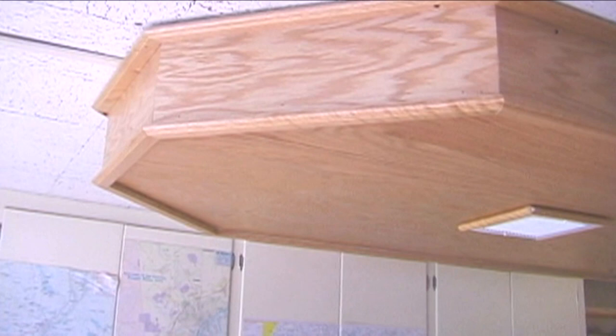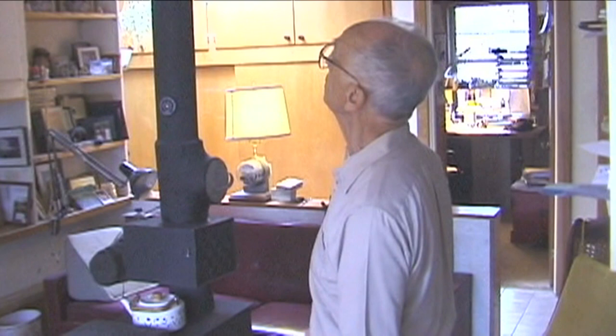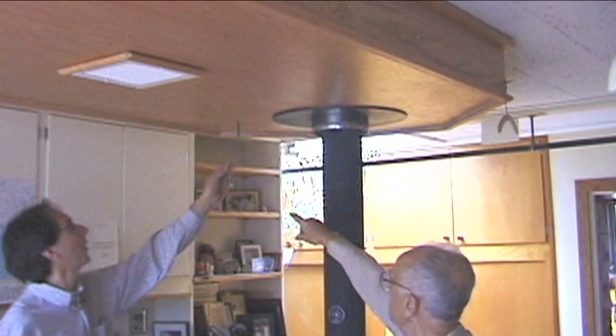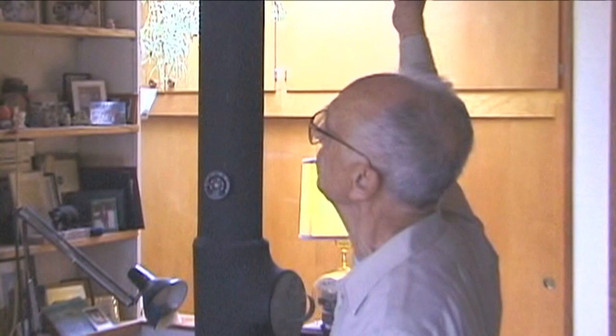And also I had a problem with the ceiling. Again, Mike Murray came to my rescue, and we pushed the ceiling back up where it belonged and did some carpentry work there. But now we have around the corner some filters, and this little pin that sticks down right there, that came from Gosi Enterprise. When it gets up to 78 degrees or so, the fan comes on, which sucks air off of the ceiling through filters, and then blows the air out through this. This air then washes down over the stove, and generally stirs the air in the building.